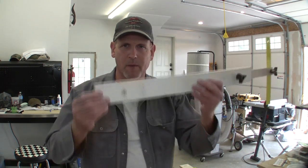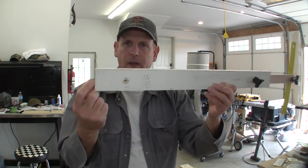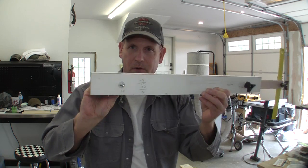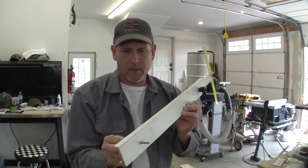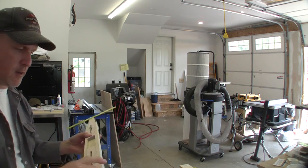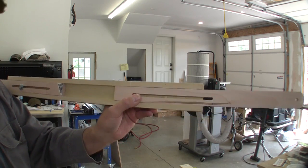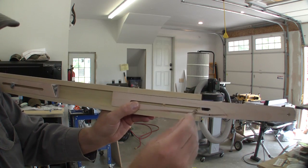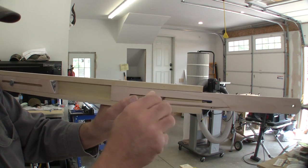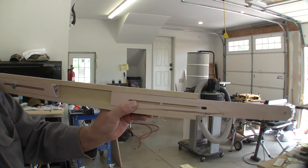On the main body we need to drill a quarter-inch hole — I set mine in about three inches from the end, and that's where your bolt comes up through with all the hardware. The best way to do this is to take your extension leg and lay it in the pocket, then come in with your drill at the three-inch mark so you're hitting that hole right in the center of the slot with no guesswork.